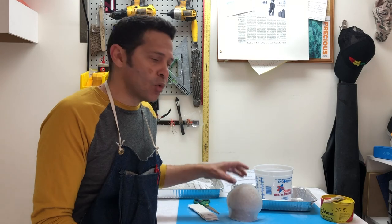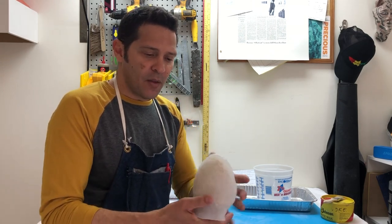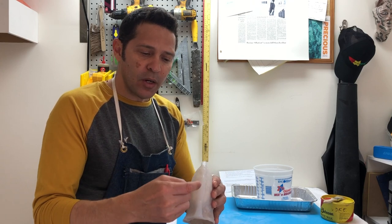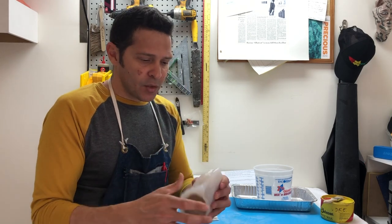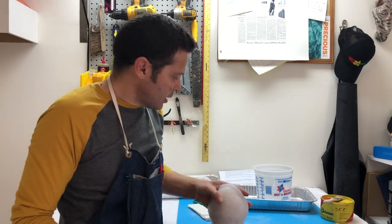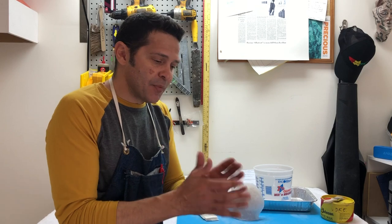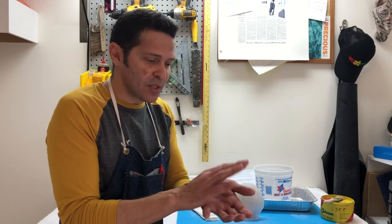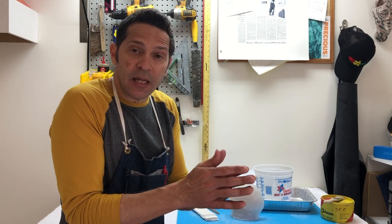The other day we made a silicone mold. We made a seam here — that's the place where we're going to cut this mold. Right now it would be very difficult to get this pattern out, so we need to cut a seam so we can peel it away. That's also where we can peel away from the wax, plaster, or resin we cast into this rubber mold.